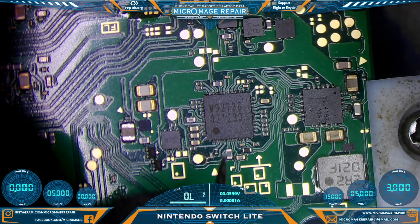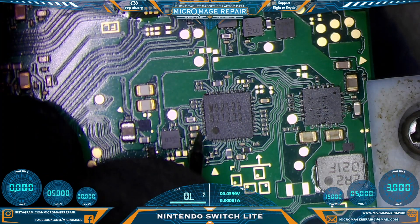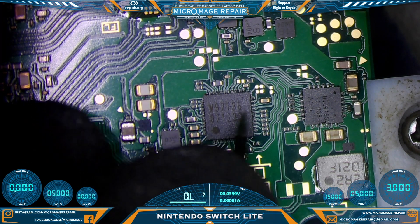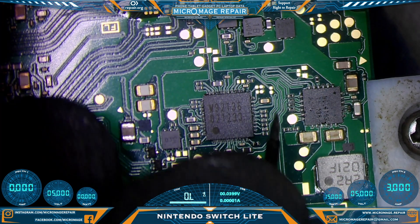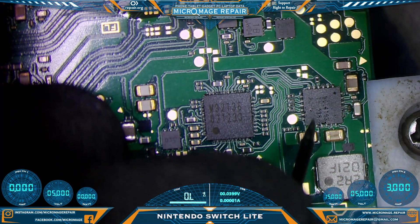Find ourselves at a ground point. Now we're going to be testing the lines going to these capacitors, or from these capacitors to the chip. They should not be short. That one is, and that one is. That one is not, and that one is not. Okay, that one's fine. So we do have a shorted M92T36 — we're going to have to deal with that problem.